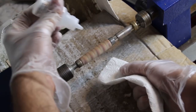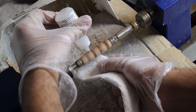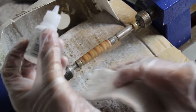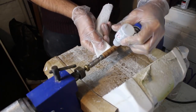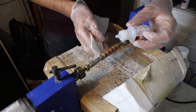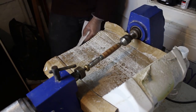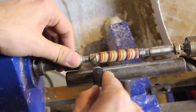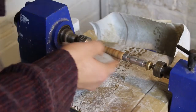The finish of choice for this pen was super glue, also known as CA finish. I changed to using tapered bushings to avoid the pen blank getting glued to them and cleaned up any dust from my work area. Then I applied a few drops of glue to the blank and rubbed them in quickly with a paper towel. To speed the process up I sprayed a little activator spray between layers. After 10 layers were applied I ran a sharp knife between the blank and the bushings just to release any glue that was attaching the two.